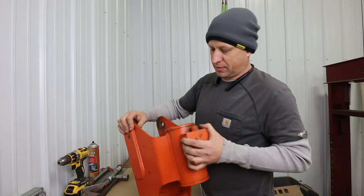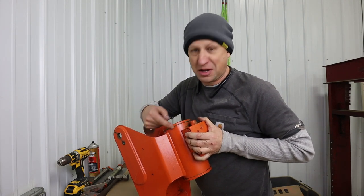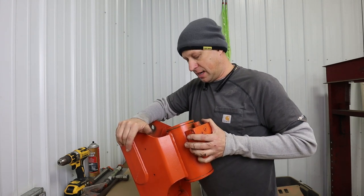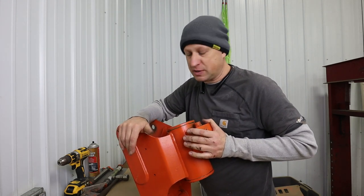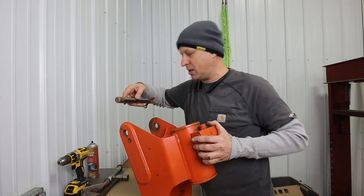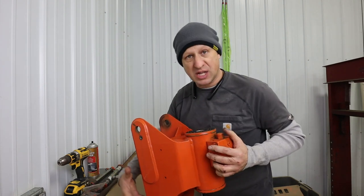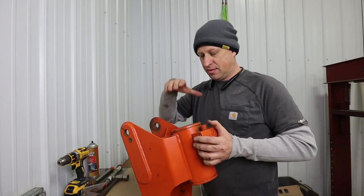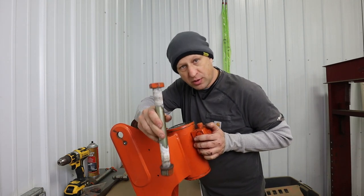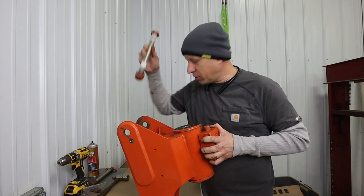And when you get around there and look, I can see a green Viton O-ring coming out here. So obviously something's failed in here and we want to get this replaced and back in service. So we've taken it out. There's a pin at the top and a pin at the bottom on the boom side. And then this part here has a large pivot bolt that connects the basket to the rotator. So we've pulled it off the machine.